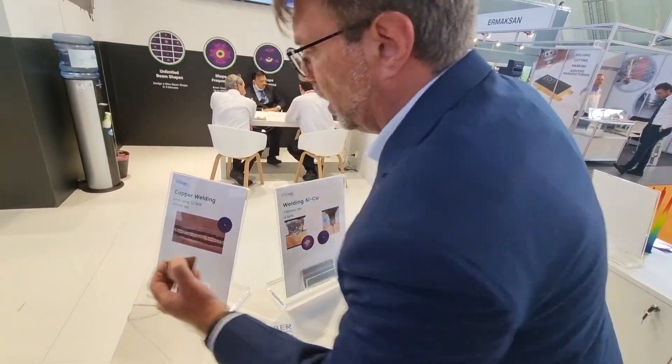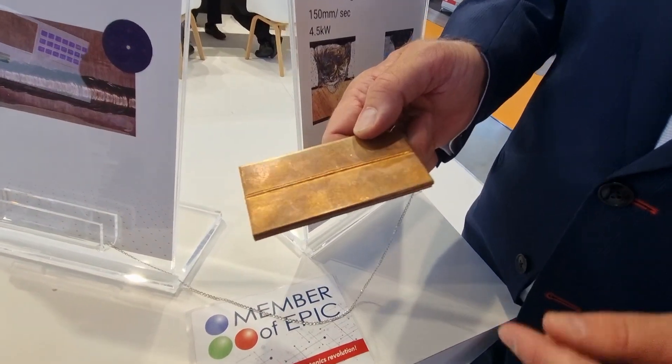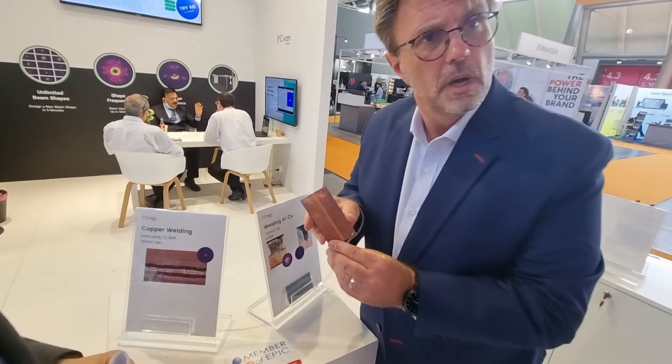This is amazing. And this right here — now copper, there's huge sputtering issues. Did you file this down or something? Where's the sputter? There's no sputtering. How did you do this? By controlling the melting. If we can keep the keyhole open and manage the material flow, that way you don't get sputtered. You allow outgassing and you have full control over the melting.